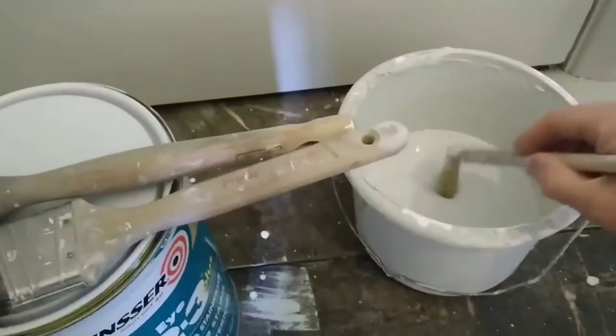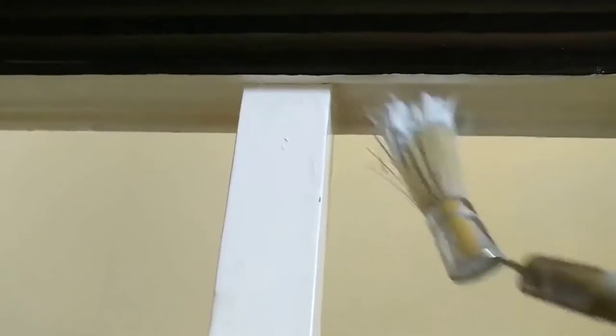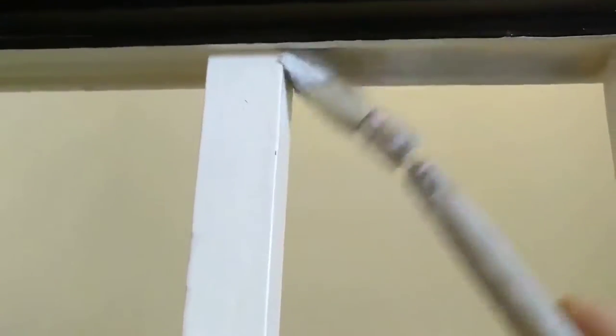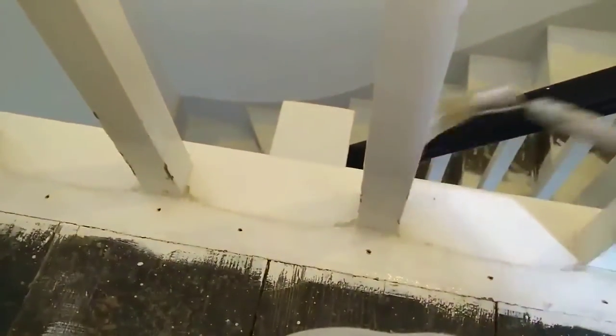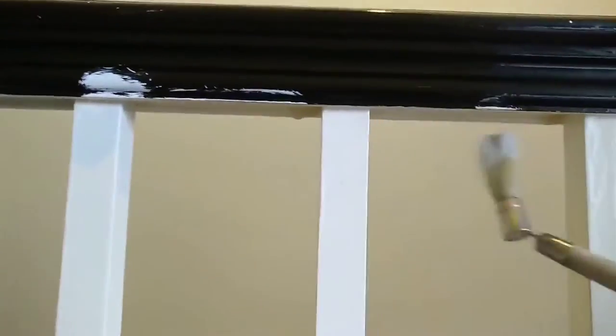This little one — it might seem slow, but it catches everything you need. That's for doing all these awkward, fiddly little bits under here, because you can get in at all the angles. Twist it round. I'll literally do that on all of them, all the way along. Then I'll lean over to do the other side so I can actually see what I'm doing. Pull it down like that, and do that on all of the spindles. I could use it here, but I'll probably use my round brush because the round brush is quicker — it has more bristles. I'll use the sash brush in all the awkward fiddliness under the handrail.